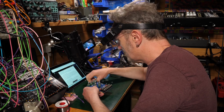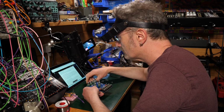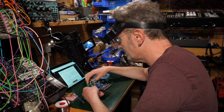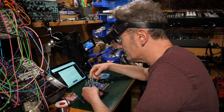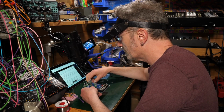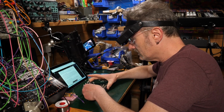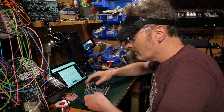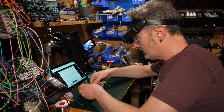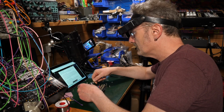So red and white, it says. Insert the red and 2 white tactile switches. How do I now tell them apart? The red switch goes into the middle and the white ones go left and right. No, locating pin, don't solder yet. Okay, so we're going to have to work out what this is. I'm a bit worried about everything poking out, so I'm going to set it on there. The LEDs are going to push up whatever I do.